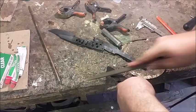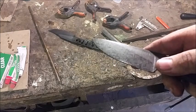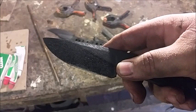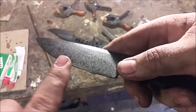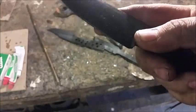If it's hard enough, this won't make a difference. You can see it's a bit shiny on the edge there — that shiny is just the scraping of the surface, scraping off the oxidizing scale. It's actually not left any dents or anything. You can see here along the edge quite clearly there isn't any deformation. You would see a little deformation along the edge if it were soft. So that one's hard.